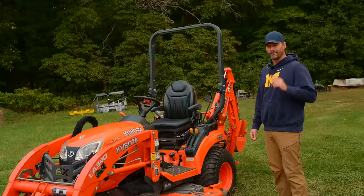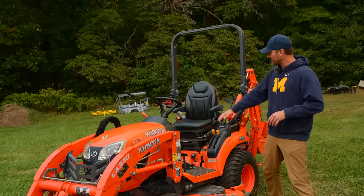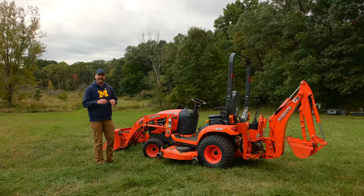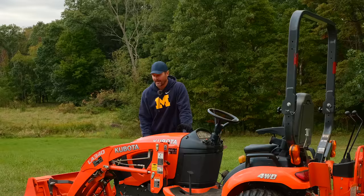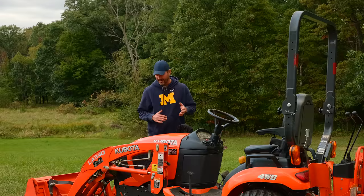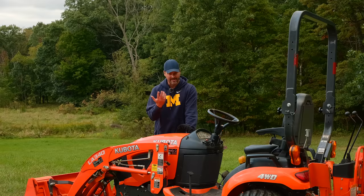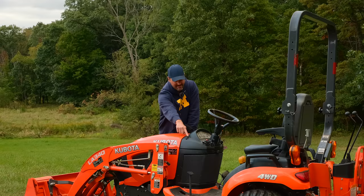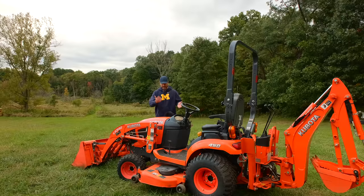You want your twenty-plus-thousand-dollar machine to look good. But the most painful thing of all is that this was sitting on a concrete floor at my shop and it was drip, drip, drip. It had a leak out of that single point hydraulic connector — very problematic with Kubota. It had another leak from this joystick at the base where it's connected — a fairly common problem. And I had a front axle leak. These leaks required three different trips into the dealer to have them corrected. It just shows how finicky this machine is in general — at 400 hours, leaks in three different hydraulic locations. And I noticed this hood latch knob is broken off and there's something missing out of the fender. It's exhausting with this machine.